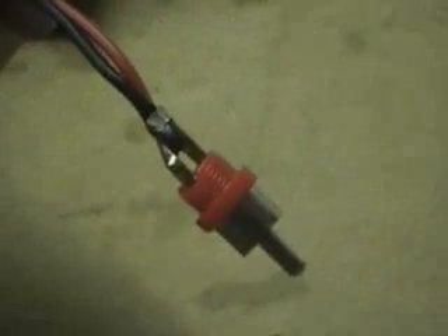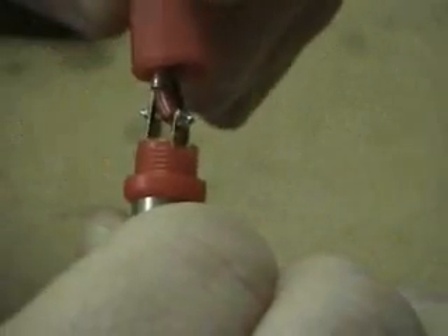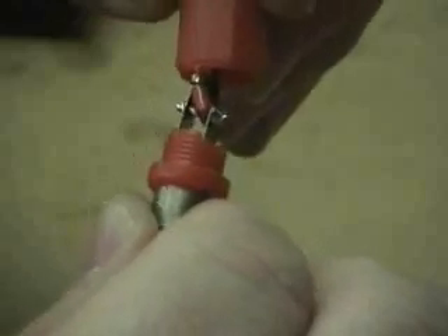The final step is to see it all fit. You should be able to pull the sheath up here, and it should happily go across our two solder joints. You may need to hold the whole structure straight so you don't get threaded, and that's easier said than done. If it's not working for you, you can bend the two sections inside, as long as there's no short circuit between the two wires — and that's where, if the insulation has done its job, it's staying there to protect. There, we can screw the RCA connector together, and we have a new connector on the end of our cable.